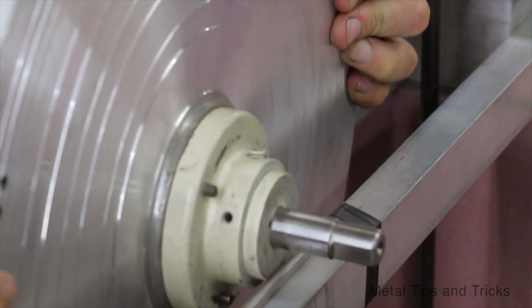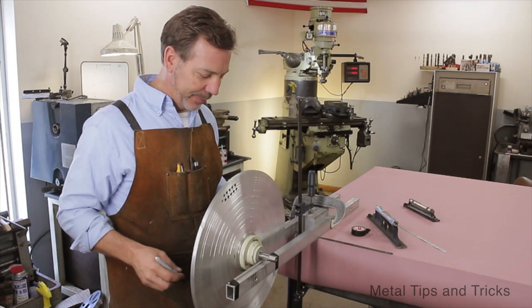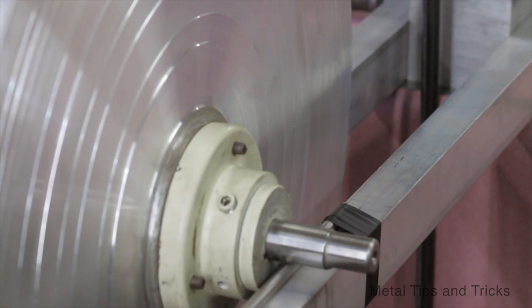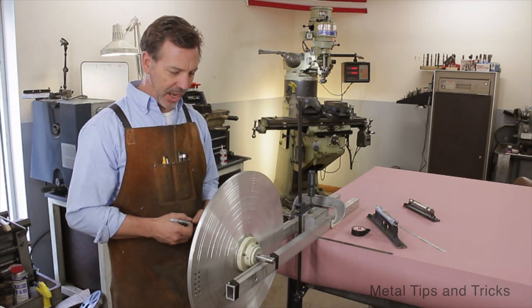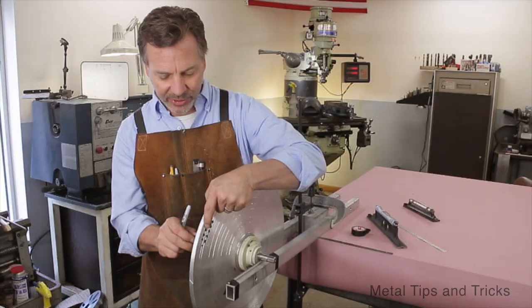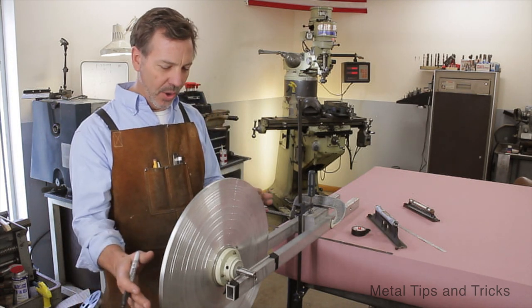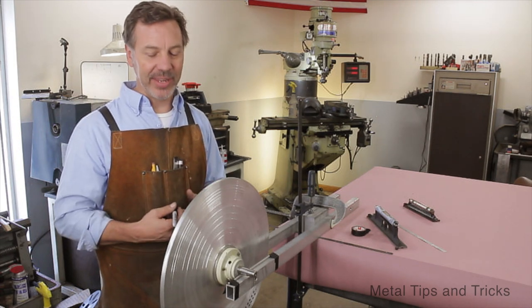I have left this all set together just the way I had it on the lathe. We want to be aware that this is a tapered arbor so it is going to be off a little bit and we just have to be fine with that. So what I am going to do is just let it set there, rotate a little bit and see what happens. I am starting to show that we possibly have a heavy spot. So if we just take this little set screw here and screw it in, you are going to see that just the little weight of that is going to throw it off balance. We want to check it at different points. When this settles out we will mark it, and if I find a spot that is consistent I know that is the heavy side.